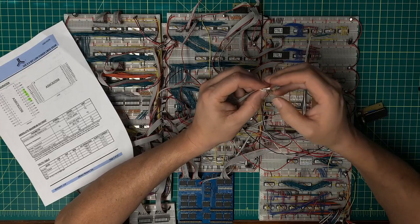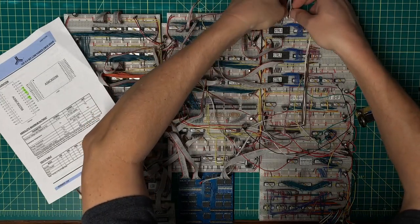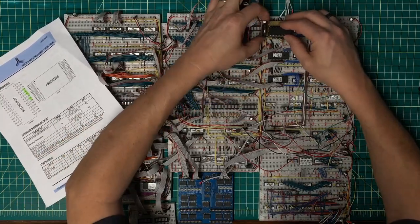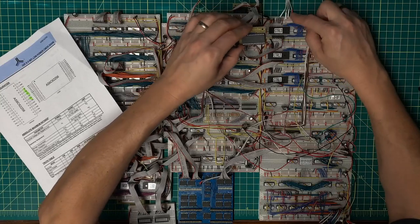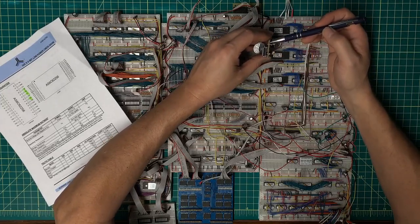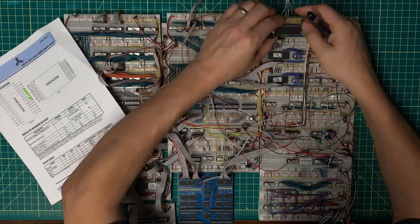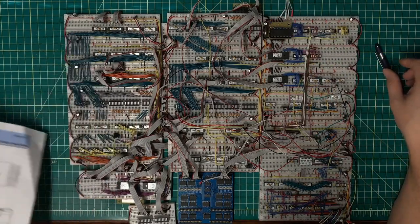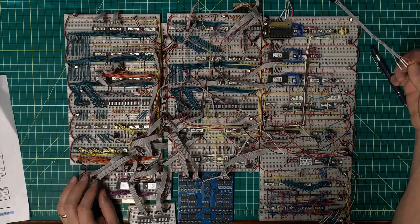These are sockets with right-angle pins intending to drop into the breadboard in the different data positions. If I'm going to drop this in here in place of the EEPROM, I need room under here to get to the rest of the pins, and the only way that's going to happen is with a right angle. I've got a bit of an overhang here which prevents me from putting a standard header. I think I can move it down to give me the room I need. Give me a few minutes — I want to demonstrate just how fussy it is to put this together.